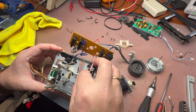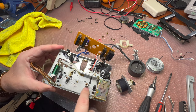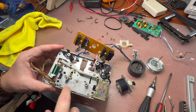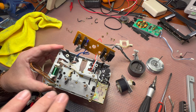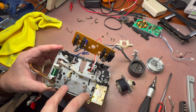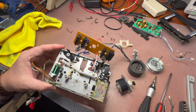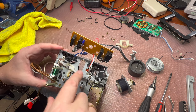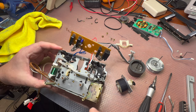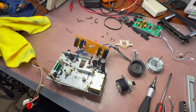So this is the head block. You see, the capstan bearings are made differently. They are made on a single cast base. That's what I like. That's why they will sit parallel all the time. They would not rely on the tape transport rigidity itself. Okay, so now I will clean up everything here, lubricate, and we'll check the motor. Let me see if I will use sticks.